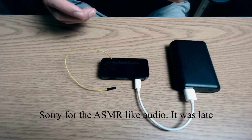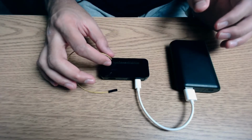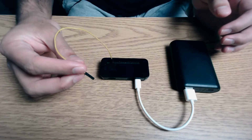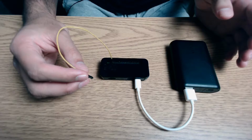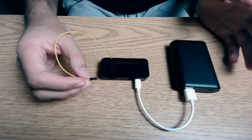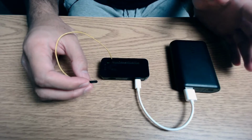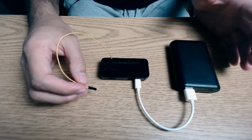So what we have here is the Raspberry Pi with one wire connected to the 5-volt GPIO pin. My hope is that if I connect the other end to the input GPIO pin that I set in the code, which was pin 11, then the same response as if somebody walked in front of the motion sensor will be triggered and a signal will be sent to the server. If this is the case, then all the code that I wrote previously will work, and the only thing I'll have to change is the wiring.